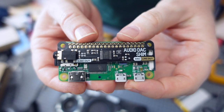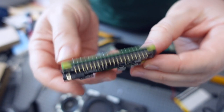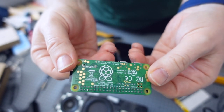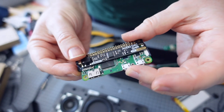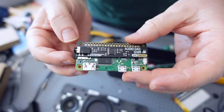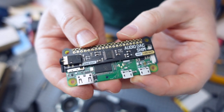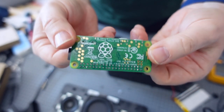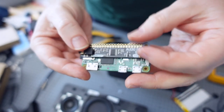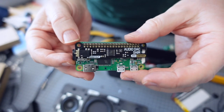And this is what will be making the sound — it's a Raspberry Pi Zero W with a very nice audio DAC shim from my friends at Pimoroni. There's an open source AirPlay system for the Raspberry Pi called Shairport Sync. I've installed it on here and I've also made the Linux system read-only, which should help make it a bit more reliable long term. I've added links in the description if you want to find out more about those things.